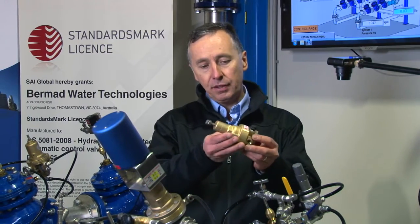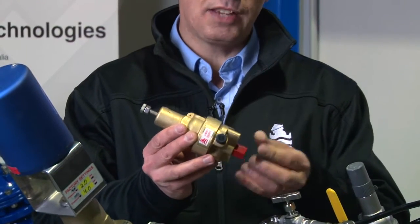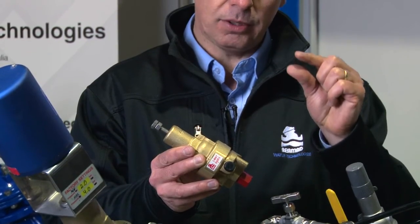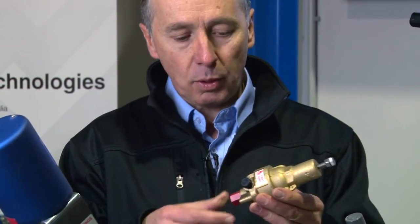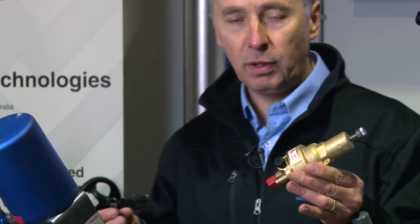The next advancement of the double-chambered design that has made the product far more accurate is the Bermad sharp three-way pilots — or three-way positioning pilots — which have very low hysteresis inside the pilot, or a dead band. The net result is when we incorporate this type of pilot in a standard double-chambered pressure-reducing valve, we maintain a very high degree of accuracy in its operation as a pressure-reducing valve. This concludes our discussion of the model 720 BXW double-chambered pressure-reducing valve by Bermad.